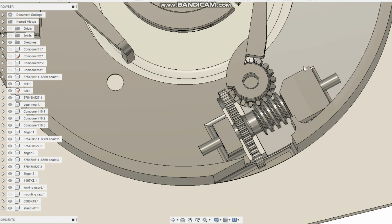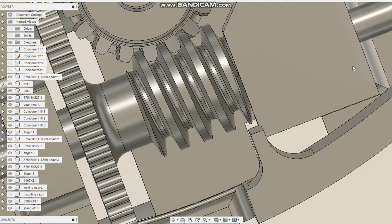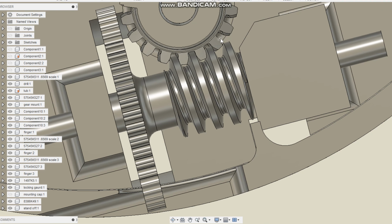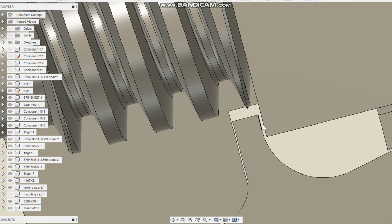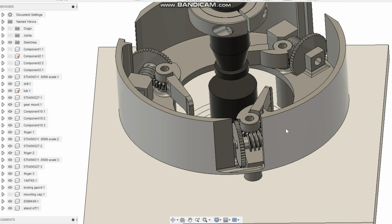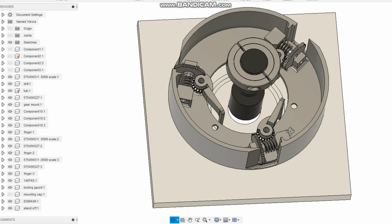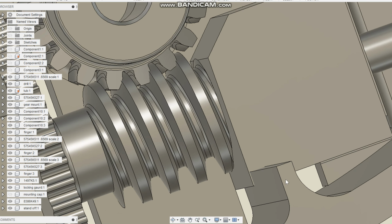Upon retracting the spring, we're going to mechanically allow for clearance here, and that is going to allow the tub drill operator to come down. Without that little bit of retraction, when they go to come down, they're just going to hit that block, right? It's just going to interfere. You can see them sort of overlap there.